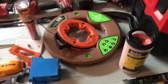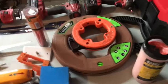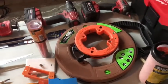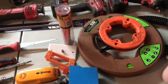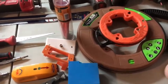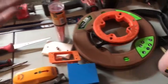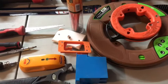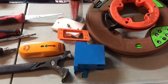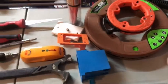Fish tape — love it. Everybody knows what you need it for. Not applicable in all situations, but once you need it, it's there for you and it helps out so much. I do use low voltage plates — it just makes it look a little cleaner. It's a cleaner installation; that's pretty much the reason why you use them. And if you need to take it off, you can cut a slightly bigger hole. It's just easy.